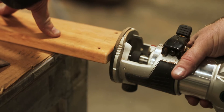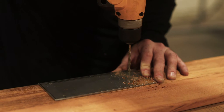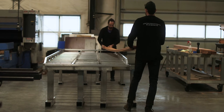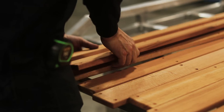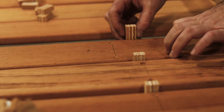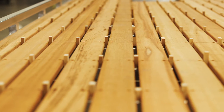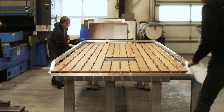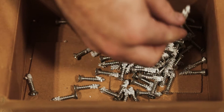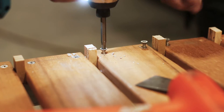I'm going to be using tigerwood — a great wood because it has good resistance to rot, so it'll basically last forever. We're going to pre-drill all the wood and then use it as a template to drill through the aluminum. There are 14 boards; we'll lay them on, put individual shims between every board to maintain perfect spacing down the length. We'll also apply a sticky wax lubricant to every screw — and there are 420 screws, so that'll keep us busy for a while.